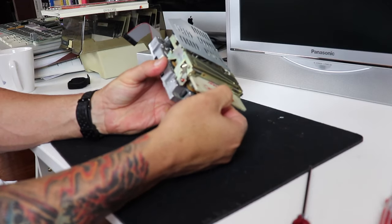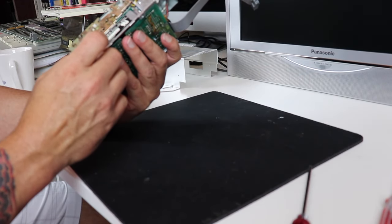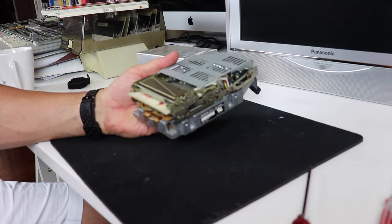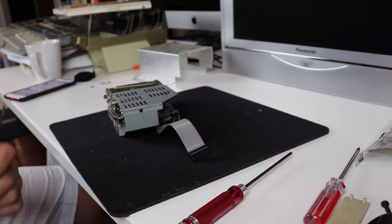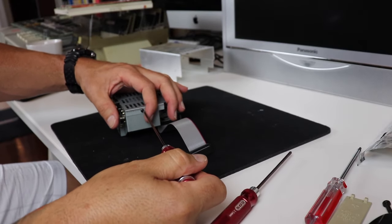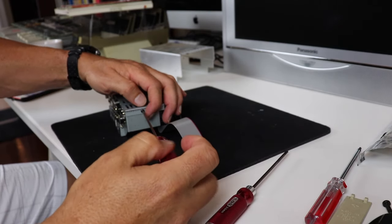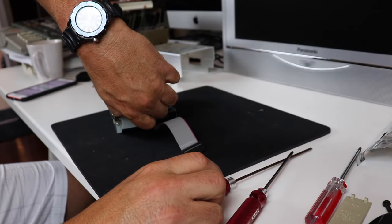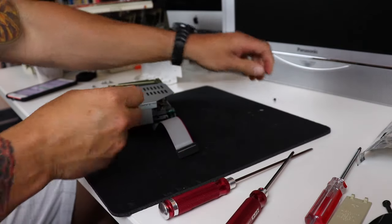And you can see here that as I put the disc into the mechanism, it does not drop. It doesn't move back. It doesn't take any action that it normally is supposed to do. And I can feel it already. I can feel that everything is hard and crusty and doesn't want to slide properly. So that's what we're going to focus on first. We're going to just clean the mechanisms and blow it out and clean it real well.